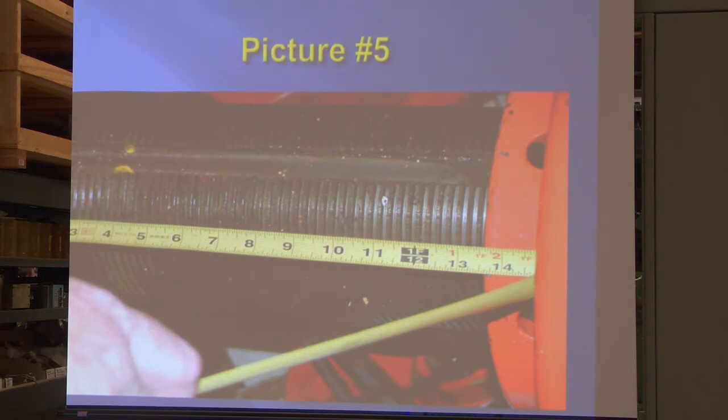A lot of utilities are doing this. They make a good buy and they get a bigger wheel, and they can add another. Once they go over about a half inch to an inch of stroke, you run out of sheave. So then you're going to be zero and 104, or whatever, and you're not going to get that out of it. You'll have to take what you get on the dial if they've done that, or you get the proper sheave, and then you could recalibrate it.